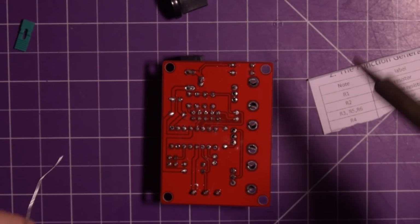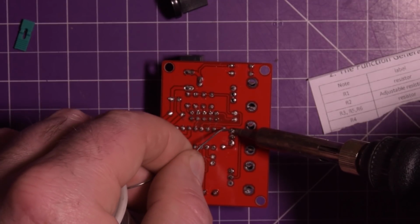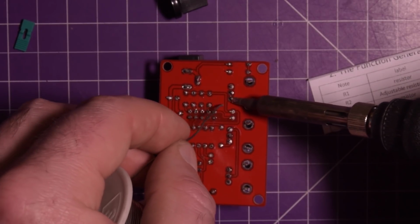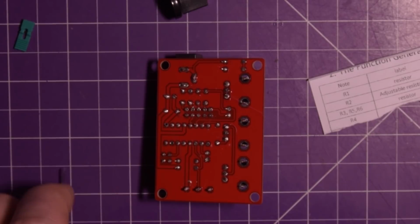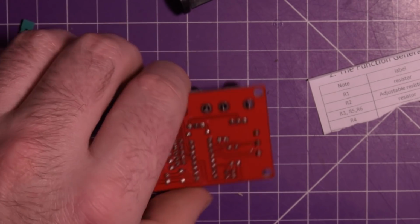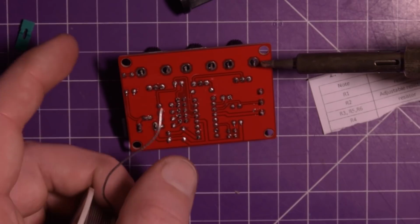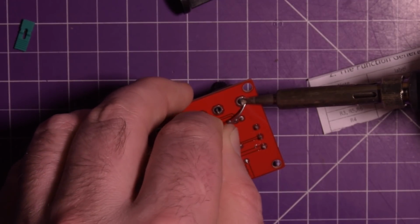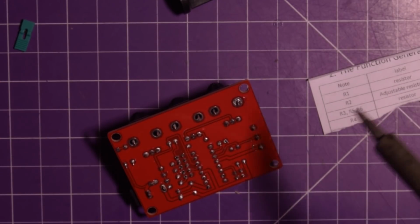That middle one must be the ground. It is sucking a lot of heat out. I have my iron set to 350 degrees Celsius. It is a fairly cheap 858 clone, so who knows how accurate it is. Could buy the soldering thermocouple to try to figure out the tip temperature, but then how do you vet the actual device that's measuring the temperature? Alright, let's see if I can get these body supports soldered. That is a large amount of solder necessary.